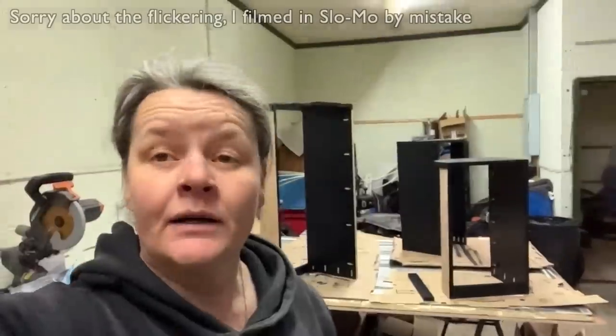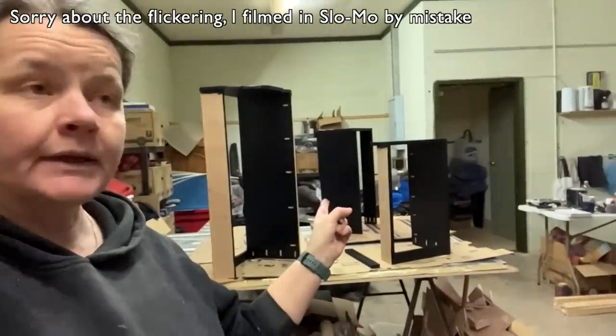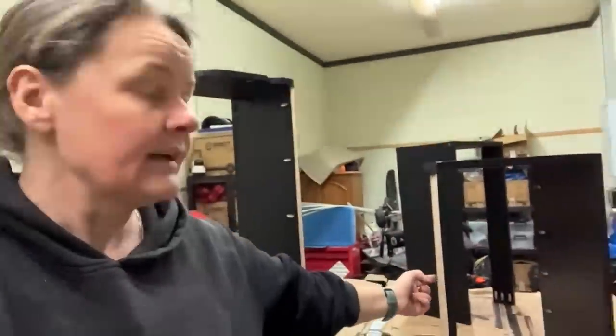I can just keep this on the side and cover it up so it doesn't get covered in dust and keep nibbling at it all day. So I've skipped a bit - three cupboards: bedroom, over the main opening door, and the one at the back. The one at the back is for the opposite side with the narrow bit on the door. They're all done, they're painted - all the bits that are going to get painted. These bits here are going to be screwed to the ceiling so I'm not worried about them. First coat on, then sand it down and give it another coat. It's five o'clock and John's been editing an epic video about his Swedish travels going up on the newly named Epic Adventures channel.